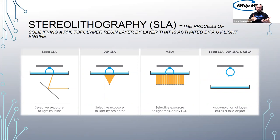So if we take that information, there are actually three different types of stereolithography printers. A common misconception is that the laser type is the only stereolithography. That's actually not true. We have laser SLA, which uses a laser-based system to cure the image itself. We have DLP, which would be like our Asiga printers. It uses a high-power DLP projector to cure the layer all at once. And then there's the new technology, like our VeriBUILD, for example, which is mask stereolithography. It uses an LCD mask. We're going to see that. Bryce is going to show us how to take that apart